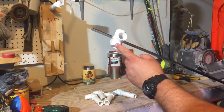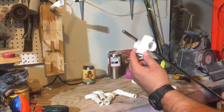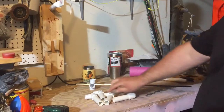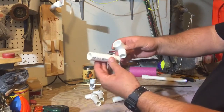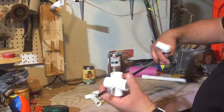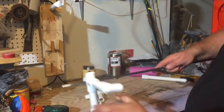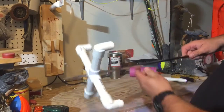When you go to buy these crosses for the kit, if there are about three in the kit total, go ahead and buy about five of these, because you might crack one when you're trying to bang on that rod. So the rest is really simple. For the hub design, I've got some 90-degree street elbows here. That is a street elbow — one side is thread, one is slip, one for each side. Short piece of PVC, I'm going to slip those on just like that. This will be slid into our cross, and you want the nipples on those facing the long side of the rod. Add one, two, so forth and so on — there's our hub.